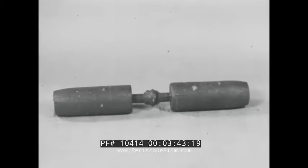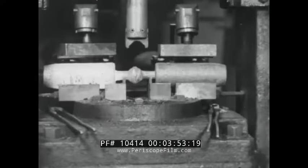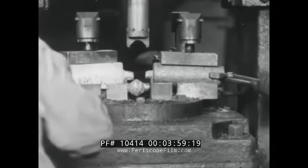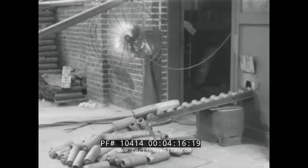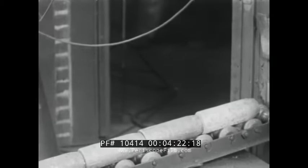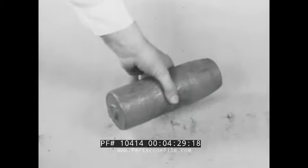This shows the forgings after completion on the National Upsetter. After the forgings have been completed on the National Upsetter, they are placed in a vertical crank press where they are sheared. The forgings are now conveyed to the outside of the building where they receive an air quench. When using X1335 steel, if the forgings are given an air quench, heat treatment becomes unnecessary because the air quench improves the physical properties to the extent that they meet the minimum physical properties demanded for high explosive shell.